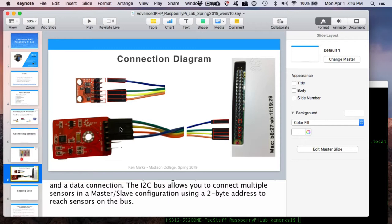So there's all these peripherals. Like this is a peripheral, a sensor that is made to communicate on the I squared C bus, and then they have a hardware data sheet on how you set it up to take readings at certain ranges. Okay? So you're going to be able to tilt this thing, and it's going to measure what axes you're in. Which way is it tilted? Or is there vibration going on? So this is the actual sensor that I use to detect if the dryer was running or not running. Okay? All right.